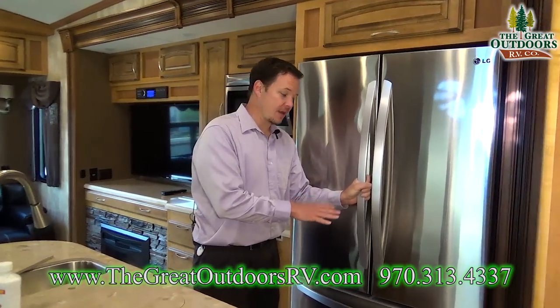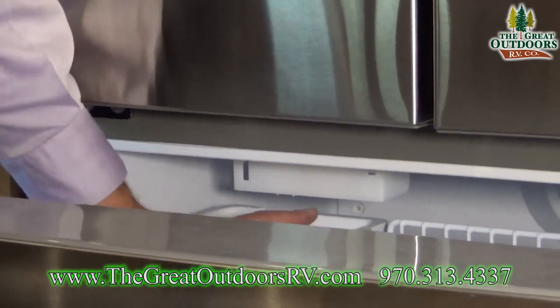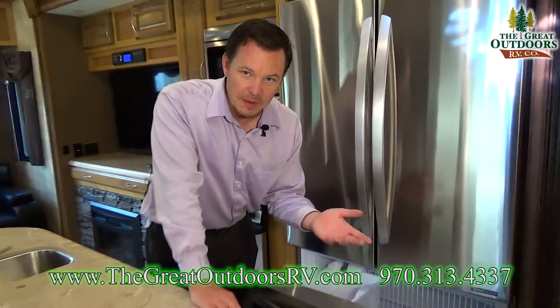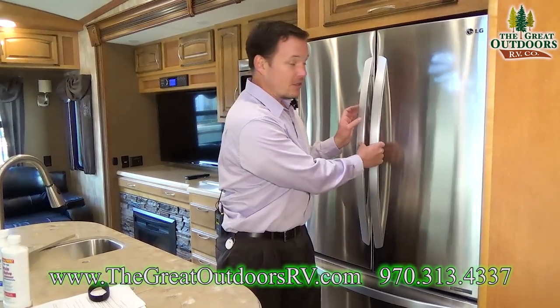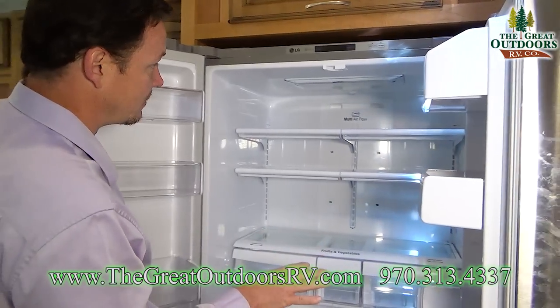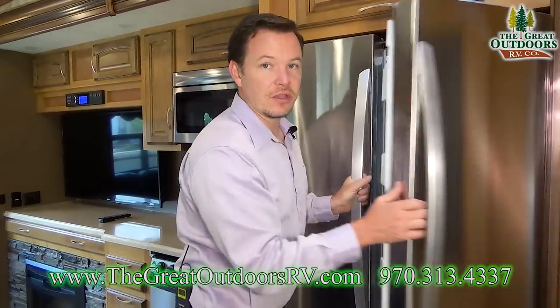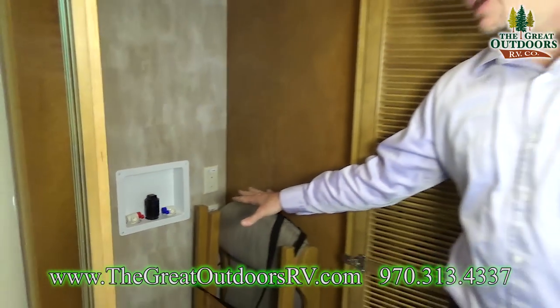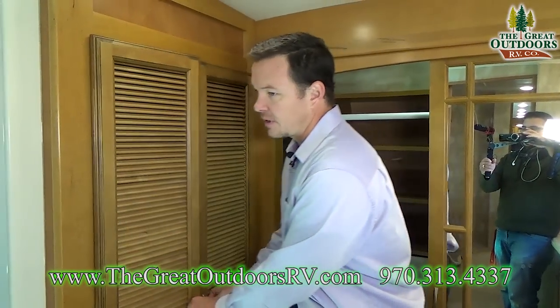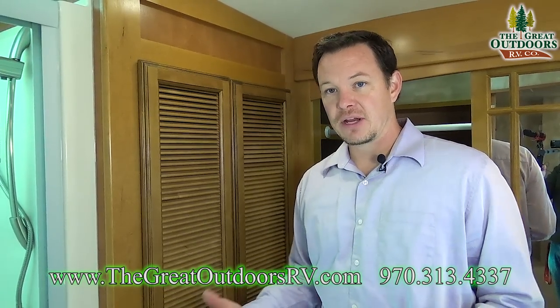You may also have an ice maker inside your camper. This is a residential type fridge so it does have an ice maker with an on-off switch. You'll need to turn this on to make ice out of antifreeze basically, and there might also be a little valve on the outside of the coach right by the I-beam that you have to open or close. Also check if you have a water filtration system built into the refrigerator — if you do, fill that up with antifreeze as well so the water doesn't bust the refrigerator. If you have a washer, run a cycle so that antifreeze is inside the washing machine. Same if you have a dishwasher — run a load with antifreeze so you don't bust up your dishwasher either.